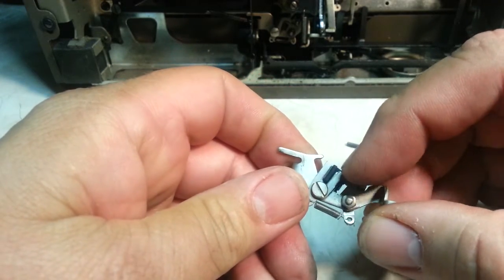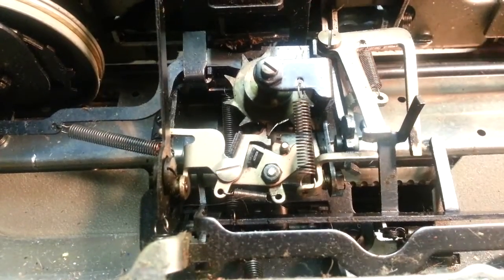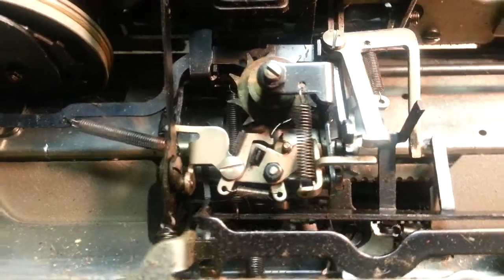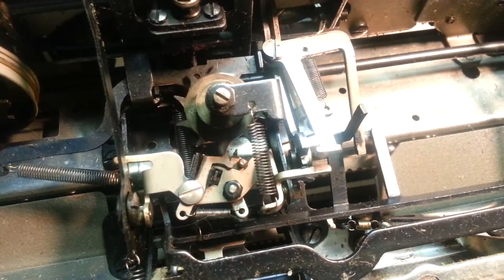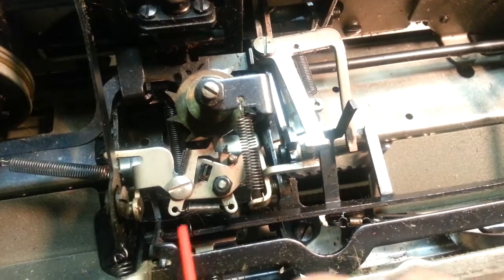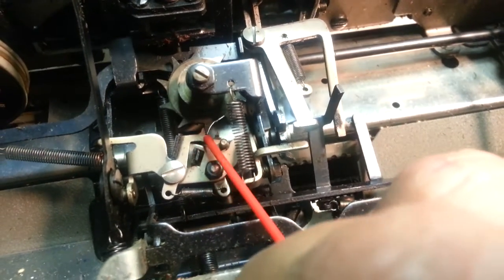So now that piece will move back further. And when this returns, the star wheel pushes that piece — but if that rubber is too big right there, let me put something in here to impede it from moving. It will make a louder click because that little piece is sticking.